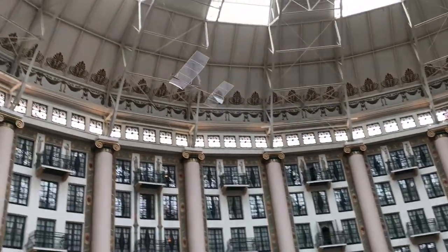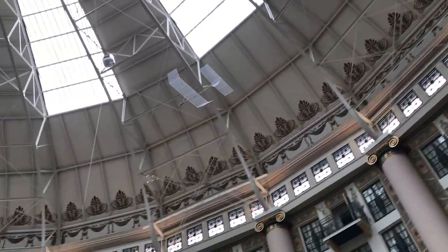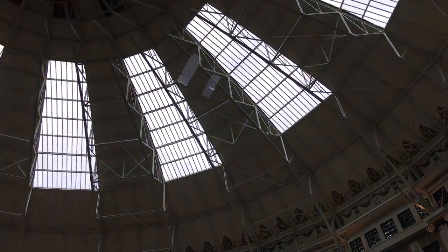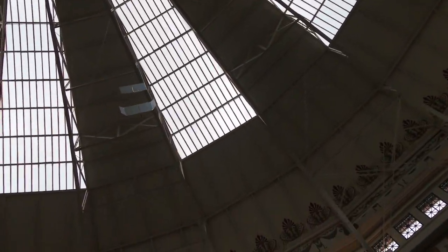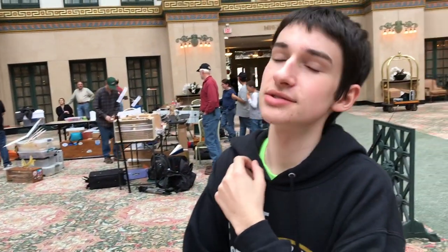I think it's been turned up. Turned up speed-wise? Yep. You can adjust the actual speed of the prop — how do you do that? You twist the cylinder in and out; it's threaded to the crankcase. It basically just changes the timing — when the valve opens and for how long. So that regulates how much flow goes through to adjust the pressure — each time the engine cycles.